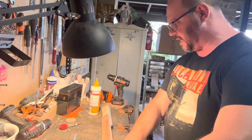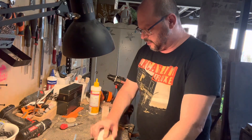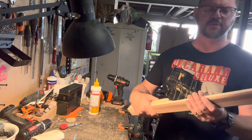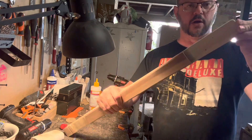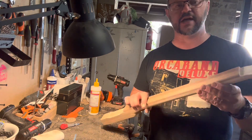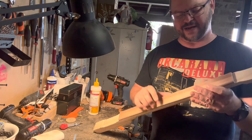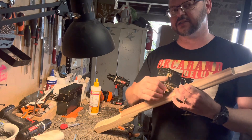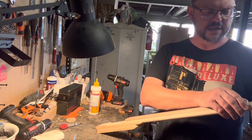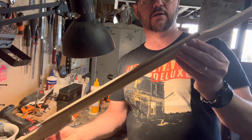I have put on a Meranti fretboard. If you're here in Australia or New Zealand, Meranti is — I believe — an Indonesian timber, though please correct me if I'm wrong. It's a really lovely material to work with. Try to get the darker variety — the darker the better for fretboard material. Super blonde Meranti is too soft; you can push your thumb in. It's fine for a fretless fingerboard, but fret tangs won't grab very well — you need a harder timber.